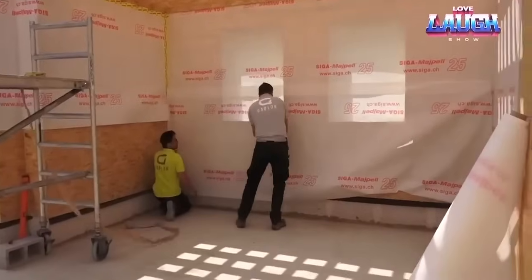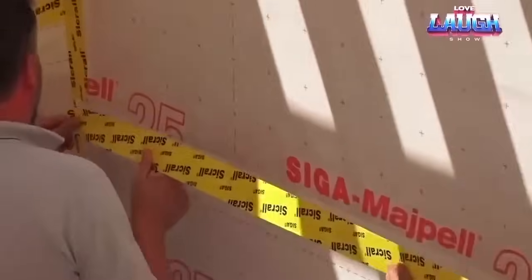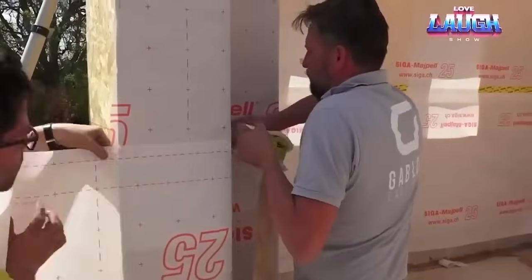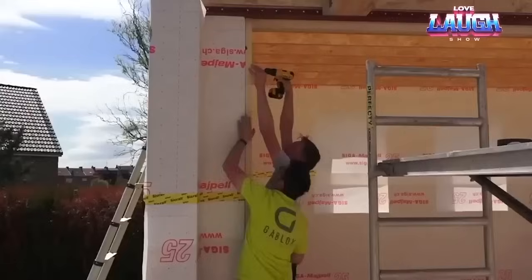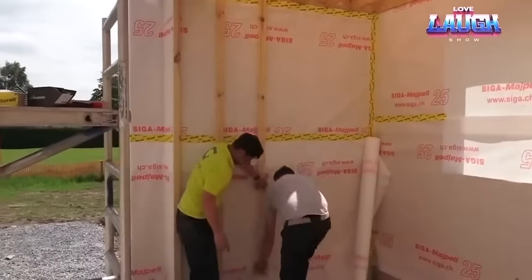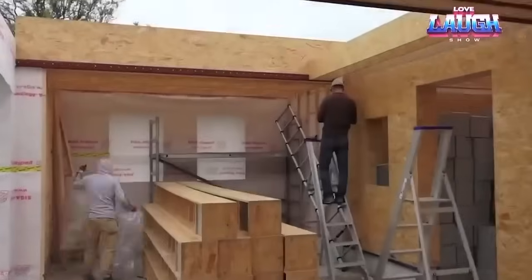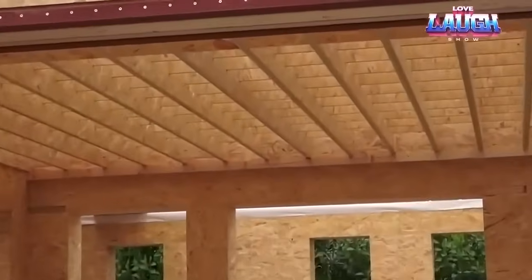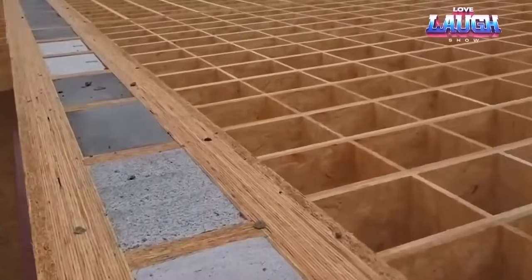In fact, the blocks are inserted into each other, firmly fixing the position by their own weight. If you want the rooms to suffer less from drafts, the gaps are sealed with special foam glue. In general, no other connecting elements are needed. Only in the corners are vertical blocks installed to make them more stable. It is noteworthy that the Gablock system allows you to build a variety of structures. It is convenient to do this due to the variability of blocks. In total, there are more than 8 elements available for order.